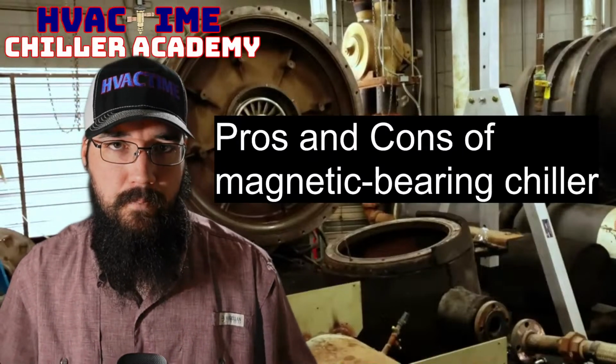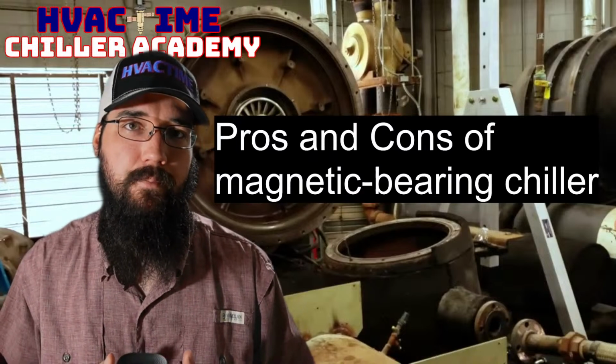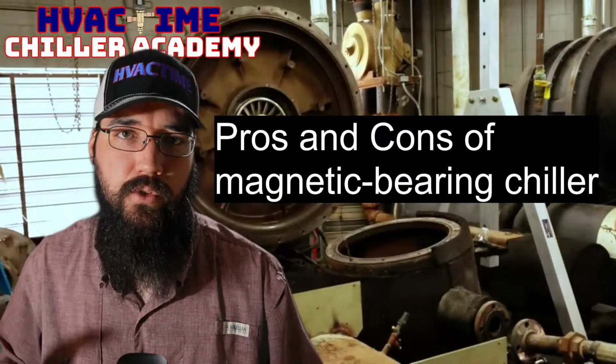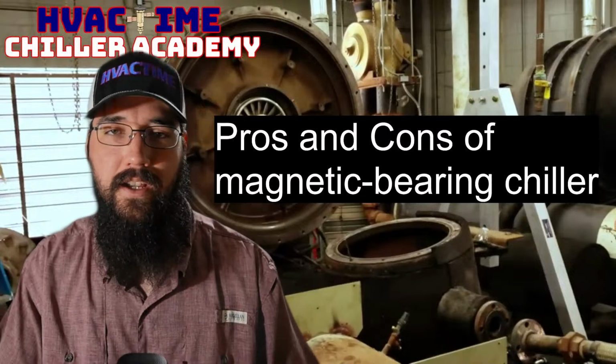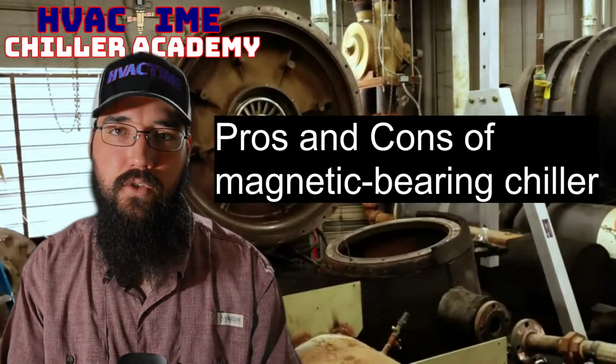Another pro would be just completely removing oil from the equation. So while centrifugals don't directly mix oil into the refrigerant stream process, like it doesn't go through the impeller like it would a scroll or a screw.